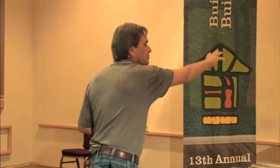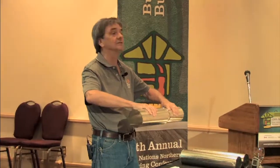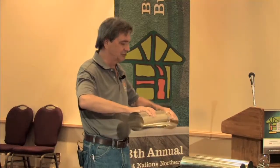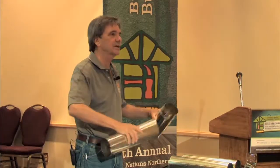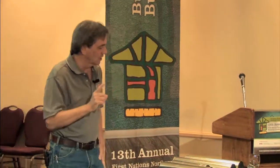And we have some heating systems like our high velocity systems. And the worst of them have these little tiny outlets. Theoretically, they do a great job of heating. But if they hit the whistle point, they drive you absolutely insane. You're sure you have tinnitus or something else, and you've got this hum in your head that's driving you crazy. And so, yes, we need to push air, and we need to project air, and we need to have flow of the air going out. But you don't want to have either grills or anything else that cause that whistle.